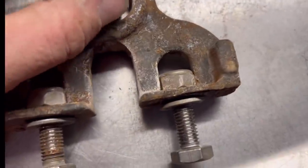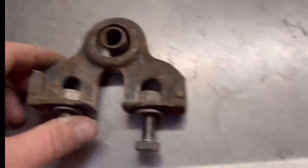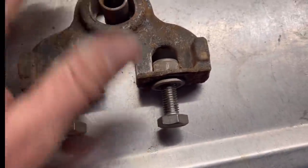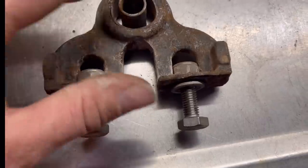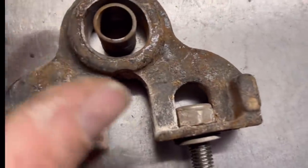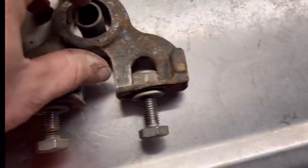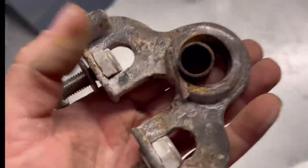But if it turns up and the bush is slacking there, it's going to damage itself again and stop working with a full tank of fertiliser. I think for what it's worth and the expense of the fertiliser, I could just treat it to a whole new part, complete with the rubber bush. I could probably repair it with tiger seal, but there's no point bodging it when you're using expensive stuff through it.